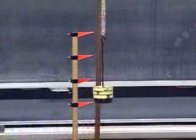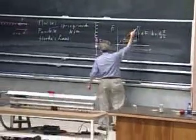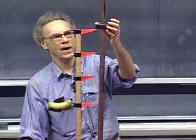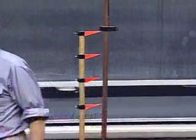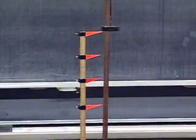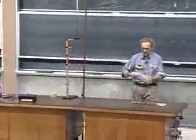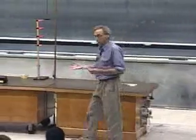And if I take them all off, so what I've done is I effectively went along this curve, and if I take them off, if it is an ideal spring, then it goes back to its original length, which it does. That's a requirement, of course, for an ideal spring if it behaves according to Hooke's law. Now, I can, of course, overdo things. I can take a spring like this one and stretch it to the point that it no longer behaves like Hooke's law. I can damage it. I can do permanent deformation. Look, that's easy.